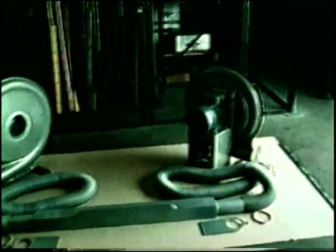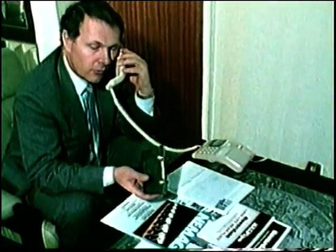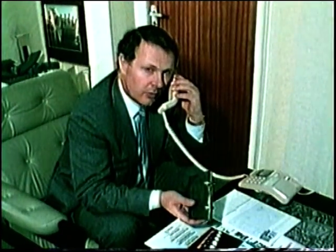The self-generating air system requires a 3-phase 415-volt input with a 40-amp surge fuse. A closed-loop self-cleaning air system is also available. Belt wear from cleaning operations becomes non-existent. Whatever the cleaning problem, contact Hoverdale for a comprehensive survey of your plant and for conveyor cleaning systems that save you money and keep the materials moving.